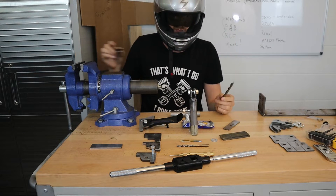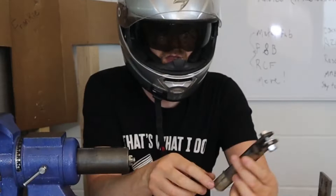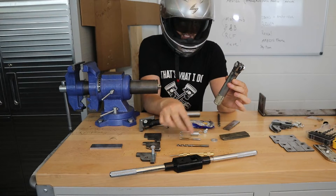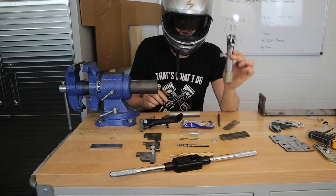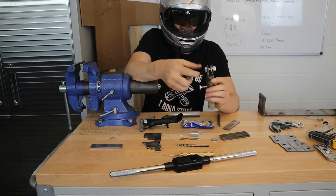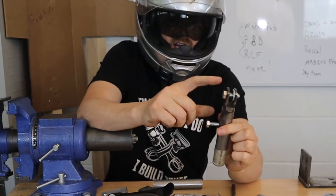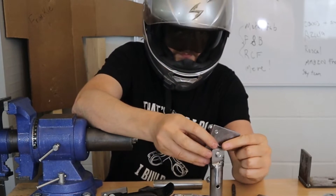Make sure you use cutting oil or some sort of lubricant to keep your bit sharp. Now with the U-shape welded in place on top, I come in with a quarter inch drill bit, drill a small hole in the side, and tap that with a 5/16 inch tap. I take the same size bolt and put that right into place. I've got the bottom part with a leg almost complete without a foot, and the top part ready to go, so I take that 3/8 inch bolt on top, use a small washer to keep it a little more snug, and I'm able to make my kickstand parts go together.